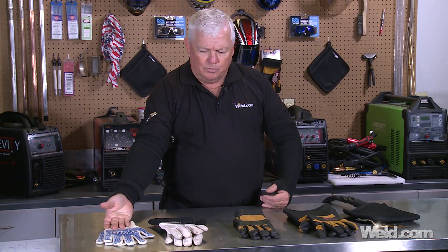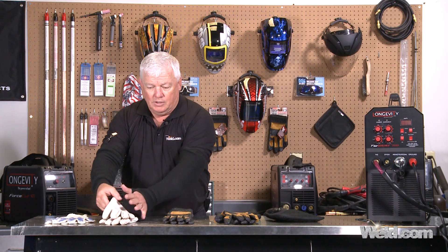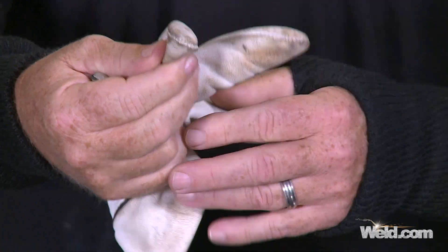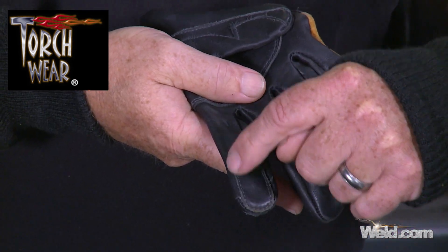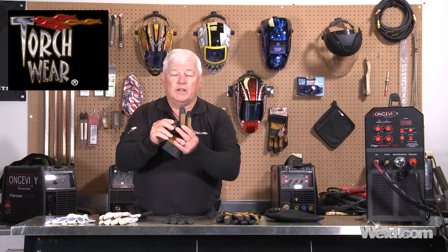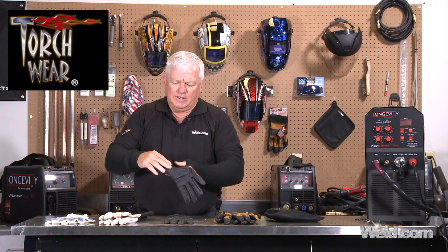Moving up the scale — this is below average, this is average, and this is best. The reason it's a super high quality glove is because they take a couple of things into consideration. If you take a look at these fingers, you pick up parts an awful lot with these two fingers, and usually you burn this finger and the leather will shrink. Well, this glove took that into consideration and put a little extra leather pad right there, and another extra pad at your thumb. Those are the common places to burn your gloves, so you get a lot more life out of it. The finger doesn't shrink up small and you're trying to feed your hand into it — you've got double coverage in a couple of different areas.